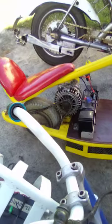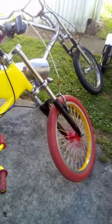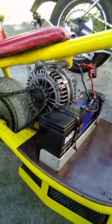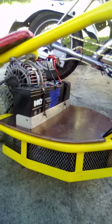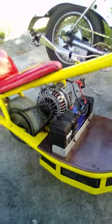Yeah, guys, I'm just doing a quick little update on these bikes. Three alternator bikes. This is the electric cockroach bike. That's got front suspension on it now. That works really well. Same deal again, but this is a 100 amp alternator, and a smaller back wheel. And that's what the gearing looks like there. And 72 volts, and 24 volts to the center mag, on a separate switch.